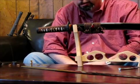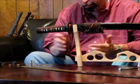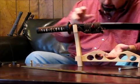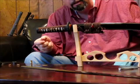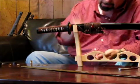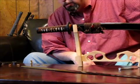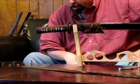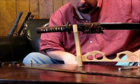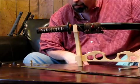And it was very impure, and it would be high carbon and low carbon. And they would take and break it into little pieces according to carbon content, stack it together, put it in the flames, get it all real hot until it got homogeneous, hammer it all together, fold it, and this would result in the beautiful thing we call hada in a Japanese sword. Well, tamahagane today is only used for art. We have pure steel today, we don't have to do that.